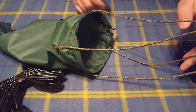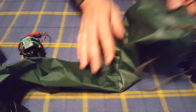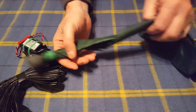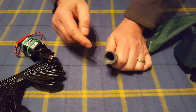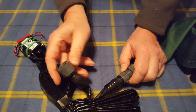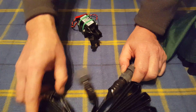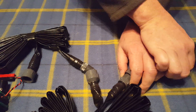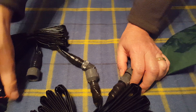You don't need much flow to make this thing work. Sewn to the bottom of the bag — which doesn't show when it's right side out — is five feet of waterproof bag material connected to a half-inch IPT fitting. Once you've got it in the water with water flowing out, you hook it up to the 15-foot hose sections. If you're on a waterfall, one 15-foot section is enough since 15 feet straight down is greater than 10. But for less steep streams, we give you five feet plus 15 plus 15 — 35 feet total — to achieve the 10 feet of head pressure needed to make power.